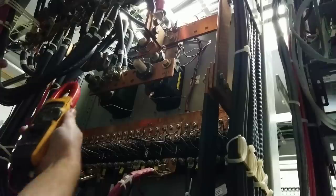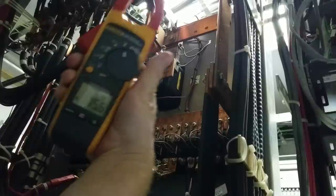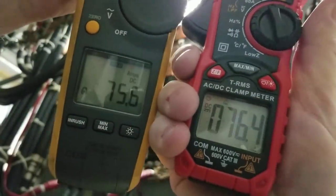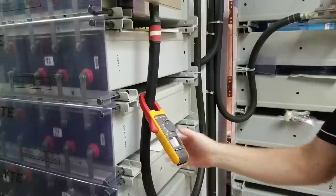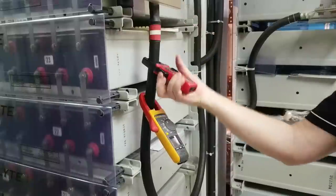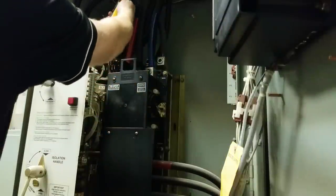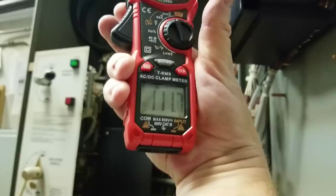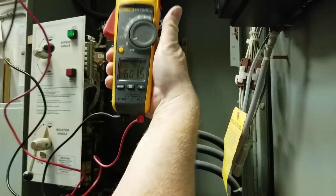To get higher currents, I took the meters to work — a 24-volt power system. The Fluke reads 75.6 A, the Kaiweets reads 76.4 A — pretty damn close. One problem I found: a heavy battery cable used for discharge checks — the Kaiweets won't fit around that big cable even though it claims to read 600 amps. Moving on to high-voltage AC at around 107-111 A on 600 volt AC: the Kaiweets reads 602 V, the Fluke reads 601 V — close enough.